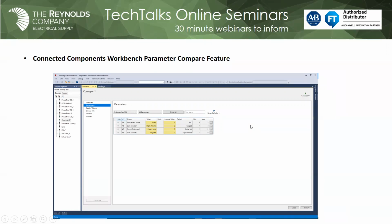So after I commission my drive, I'll click on Show Non-Default, or I'll do a compare. And you can see on the screen there, in this particular drive, I've only had to change 4 parameters. And so it shows you which 4 parameters and what those values should be.